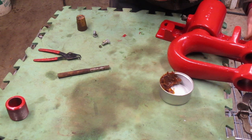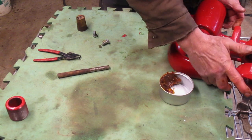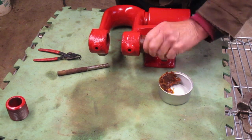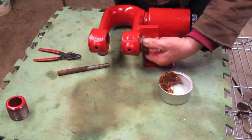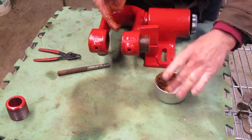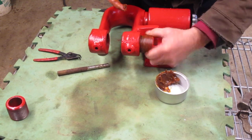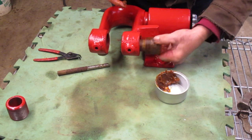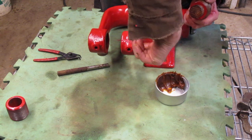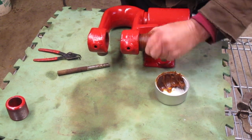You can put your guide in and then just start putting that together that way — that's all you do. I've got to stay on my magic carpet. Now you're just putting that in. I should have put some grease on these threads in here but I didn't think about it — I think I will. You don't want these to freeze up from rust. When the sawdust comes through here, any grease left over is going to get sawdust blasted through.